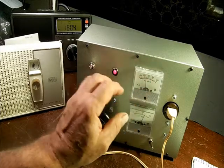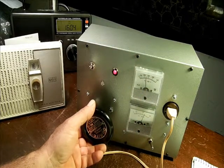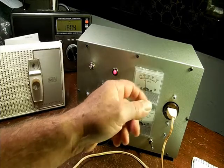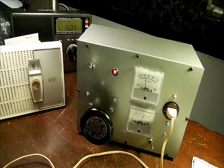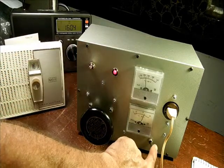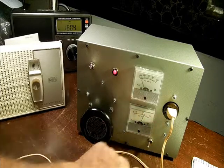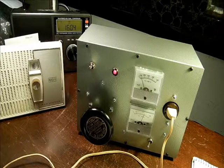So this is about 220 milliamps in the amps. Turn that down and make a reading a little. 220 milliamps. And if I hook in the 2-times switch, it goes down to 110. So that circuit is working pretty good.